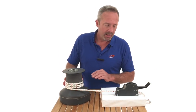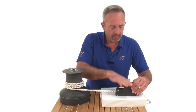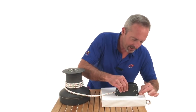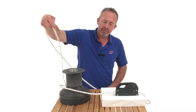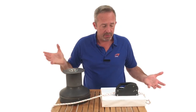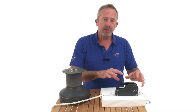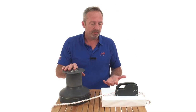When I'm ready to stopper the line while it's still loaded on the winch, I close that. The cam comes into contact, I ease this off, and the rope settles into the cam and it's locked off. Now I can take the line off the winch and free it for other duties — so I could have a battery of multiple clutches here with multiple control lines and halyards, all being serviced with one winch.